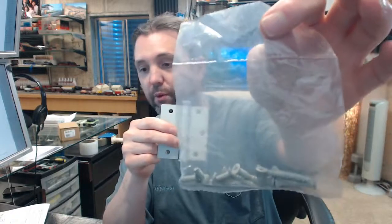We went over the screws earlier. There is a link below this video to the template, and that document is very handy because it shows everything important dimensionally about the hinge. It shows an overview of where the door is located. Not exactly, but you get the concept. The table in the center lower third of the page gives you a 5300 and a BB 5300 in that steel column. You can get the 5300 with ball bearings, that's BB. If you change the last number in the part number to a 1, that means it's going to be a brass or a bronze base material. If you change it to a 2, it'll be stainless steel. Very typical.